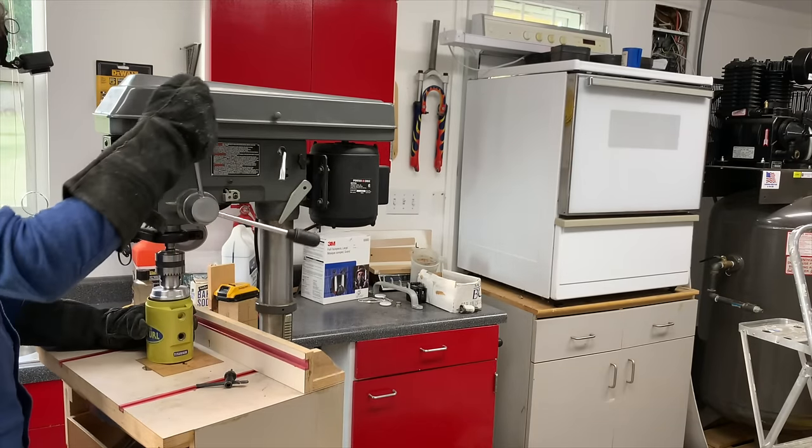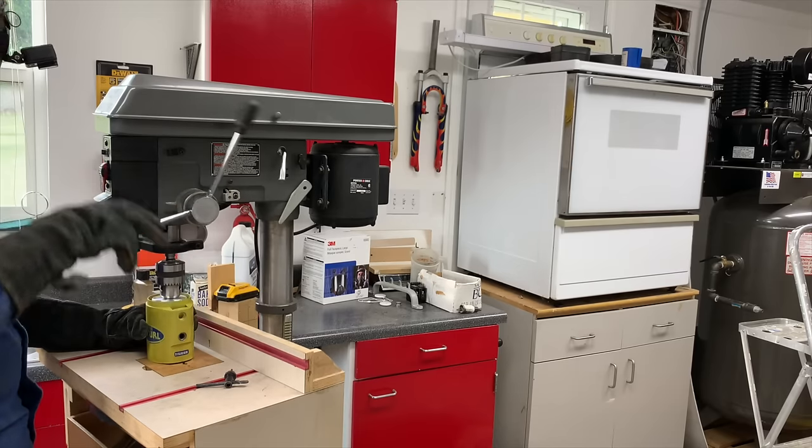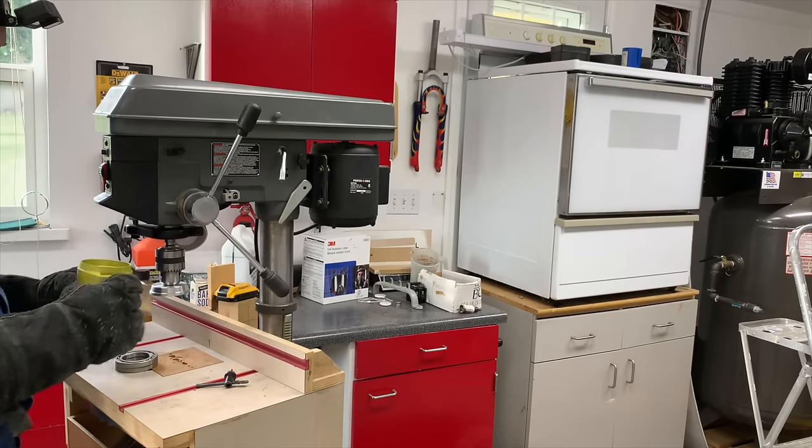I won't go through the full teardown of the LC42 here — they're more or less the same, and all of these units have generally the same components. There are a couple of extra bearings here and there and a larger circlip. If you have a 31mm, 42mm, or 52mm Pro Furl unit from this same era, these directions will more or less apply to you as well. I started using the drill press during this last piece to start taking the bearings out and it actually worked really well. Someone's going to be screaming at the computer that you can't use a drill press for that, and I sort of agree, but it is a press — and although it's not as good as a shop press, it's what I have and it actually worked really well. It offers some advanced leverage, and if you don't put too heavy a load on it, everything should be fine.